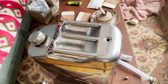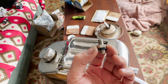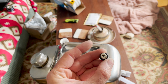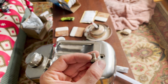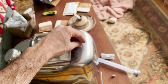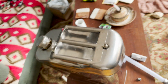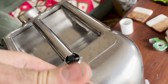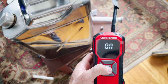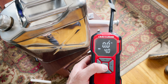There aren't a lot of manufacturers that make an M10 Schrader valve. After a lot of looking around I finally found a company in the UK that made the exact part I need — a Schrader valve on one side and an M10 bolt thread on the other side. It threads right in, there's a little O-ring there, and that seals it up and makes it airtight. This just hooks right on and I have it set to four PSI.